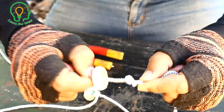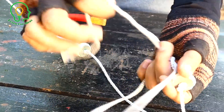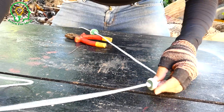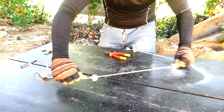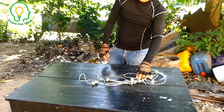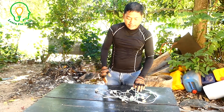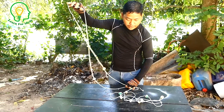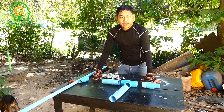Make it on both sides — here and here — the same. All rubber pieces, you have to do the same. Make sure the distance from here to here is similar or the same; if you have a meter you can measure it. My project uses about seven meters because my well is not too deep. If your water level is deep, you can use a longer length depending on your water level.